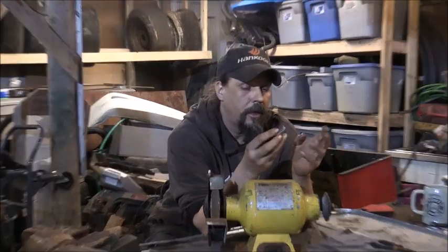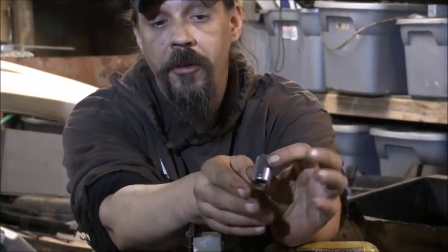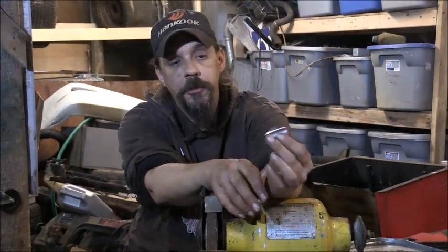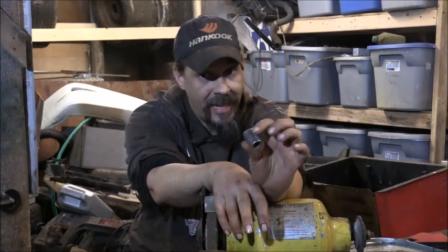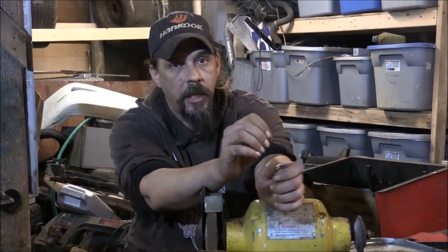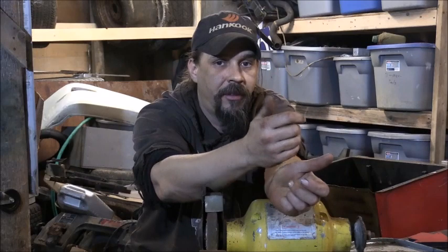How do you know if it's too cheap to buy? Generally, if you price your stuff when you start looking and assume that either half of it's junk or all of it's junk, there's different things you can do with it. Like, this is a broken no-name socket. Sometimes what you can do — I always keep these instead of throwing them in the scrap bin — use them to drive bearings or other things, make other tools, even as a one-time-use thing. That now has value. You can't always tell — you know, made in China, so it's either the tempering's too hard or too soft, the jaws are going to open up under pressure, or the wrench is going to bend, which I've done with my bare hands. You never know.